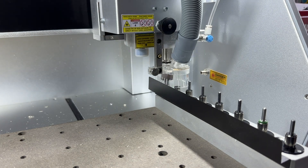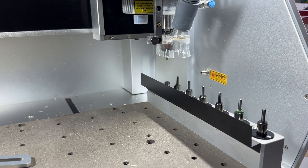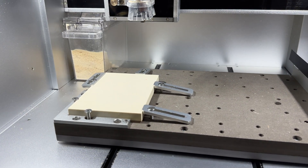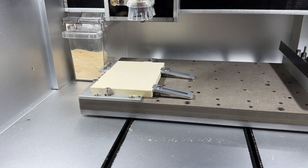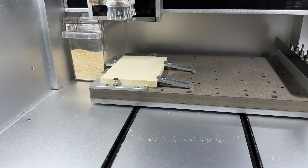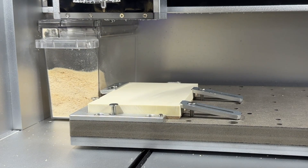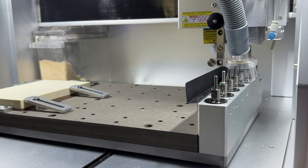The overall manufacturing time for this project will be about two hours. The Carvera will start by picking up the wireless z-probe before it scans the perimeter of our part with the laser pointer. Check to make sure that no clamps are in the way or obstructing within this margin. The Carvera will then probe the point set within the controller to measure the height before switching to tool one automatically.